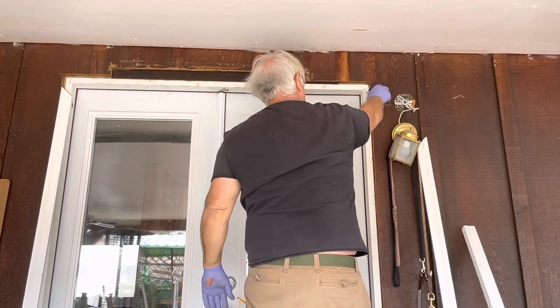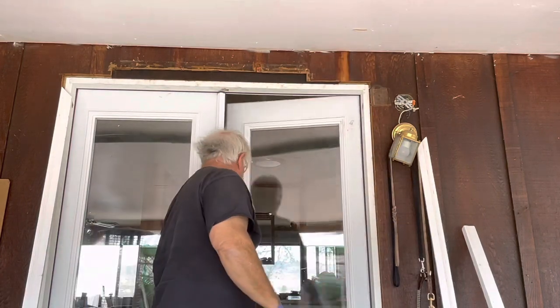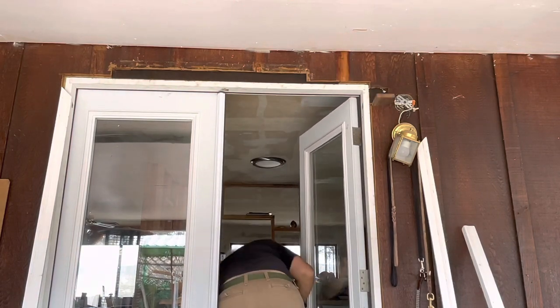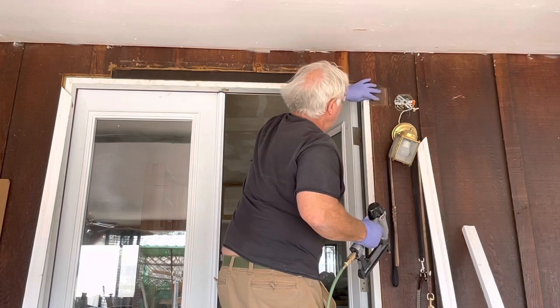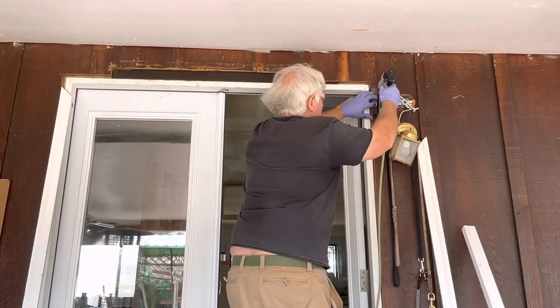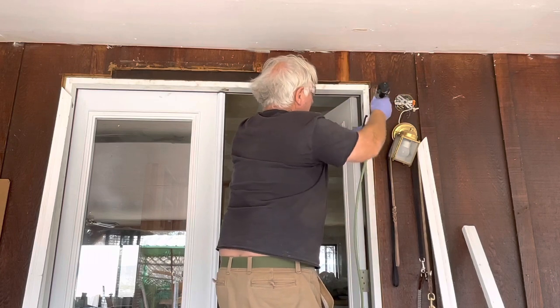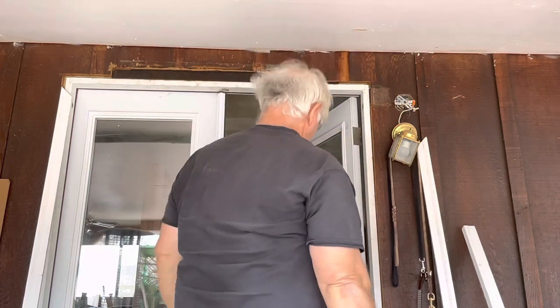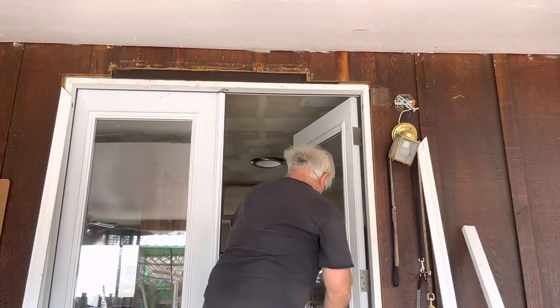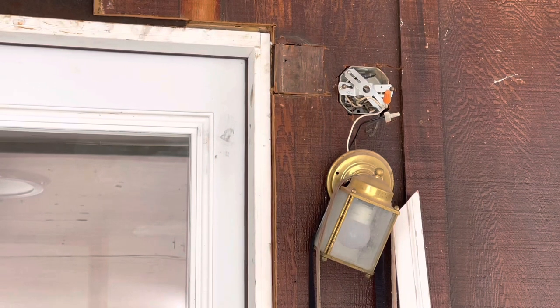There's a lot of ways to fill this and fake in the grain. You can put fill in there, let it dry a little bit, and then score it with a chisel. It's really unfortunate, I should have cut this tighter. But there's going to be molding over that. The main thing is I wanted to back that up to show you exactly how this is going to work out. Sorry for the crappy angle and a crappy cut, quite frankly.